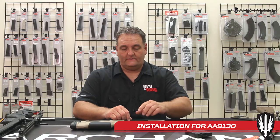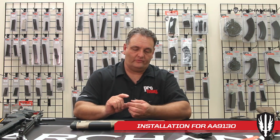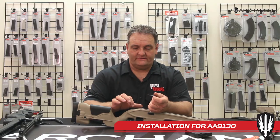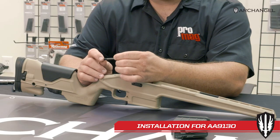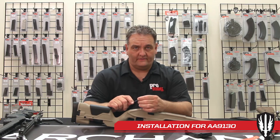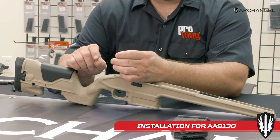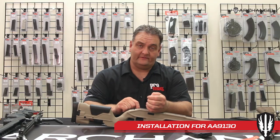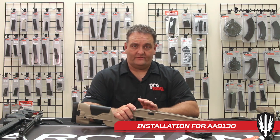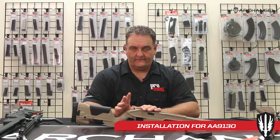We have changed and updated the rear pillar of this thing, and it will soon be shipped with a shorter screw. It'll still be a long screw and a short screw — we've changed the rear pillar to accept the shorter screw. The reason is we found that Mosins have a fairly wide variation in the rear thickness of the receiver, and some are actually thinner, allowing the screw to go further down and break the bottom of the trigger guard. Unless you have one of the thinner Mosins, it works as designed, and future rifles it'll be a non-issue.